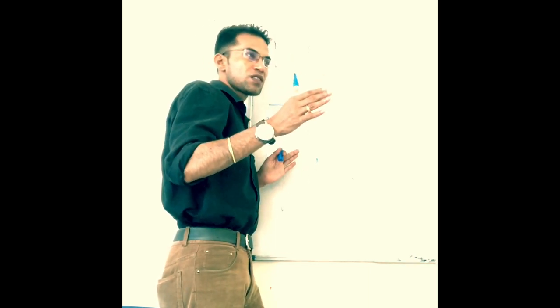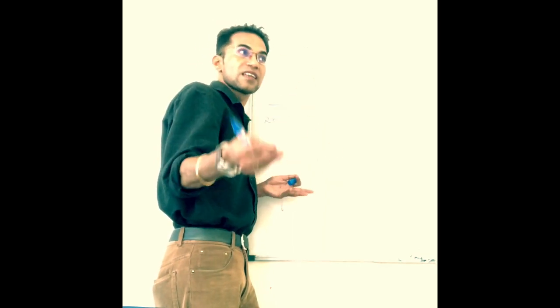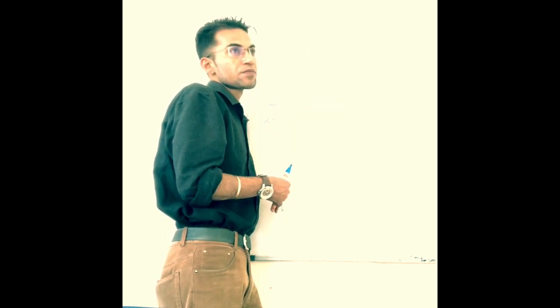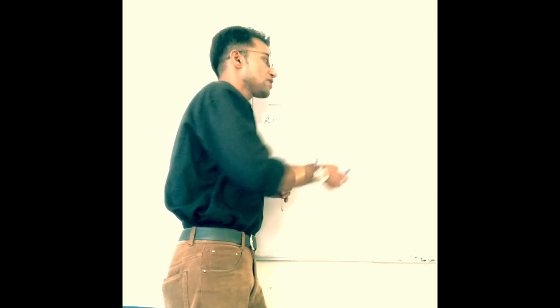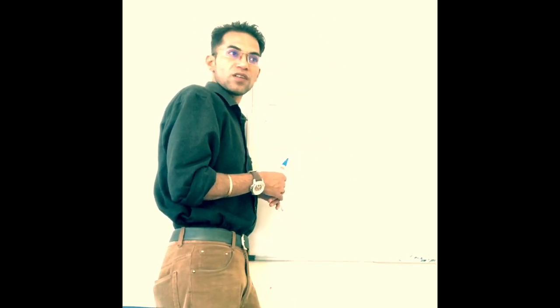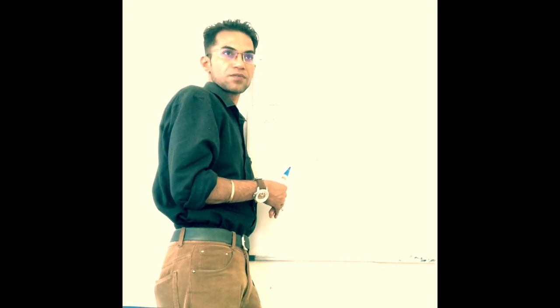Do I need the same type of snip for left hand and right hand? We can have the same type of snip for left hand and right hand. In that case, that would be called a symmetrical snip. Sometimes, for left hand curving cut and right hand curving cut, we require different snips. So that would be an asymmetrical snip. If the snip is used to cut in the left hand direction, it would be identified by some color. If it is used to curve in the right hand direction, again it is identified by some color. So right hand, which color is used? Green.